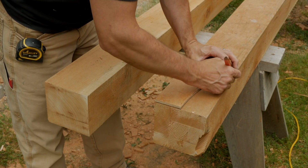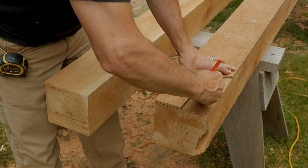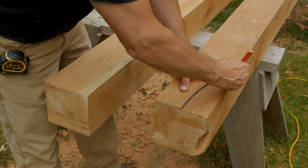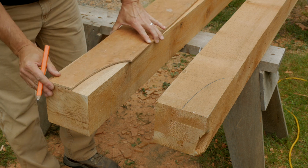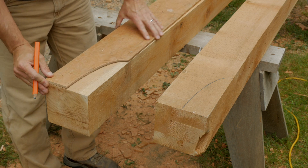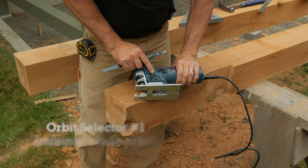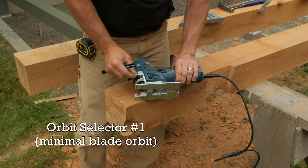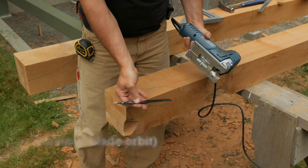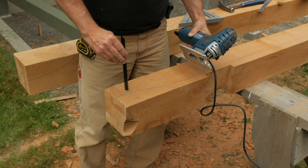See the links for these in the description below. The beams I needed to cut were 6x6 red cedar with a quarter ellipse profile. I made a plywood pattern and traced it onto both sides of each end so I could check the accuracy of my cut. I've got it on orbital mode 1 and the 9-inch blade also by Bosch — we're going to come in this direction first.